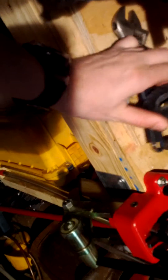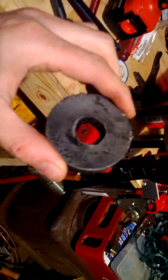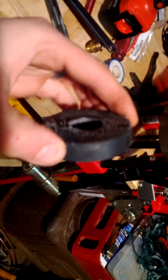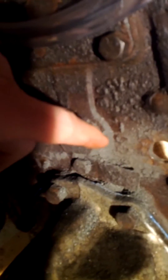What I did was put a dirty sock in here as I was drilling, and I also have this earth magnet — you can see all the shavings on it. I had it sitting back here like this and it basically kept all the shavings from going into the case — all the shavings stuck to the back of this magnet.